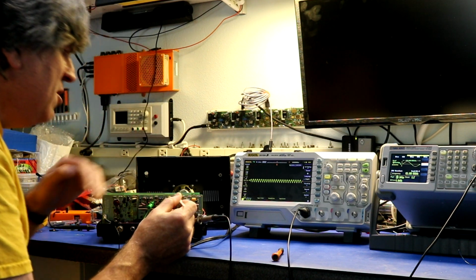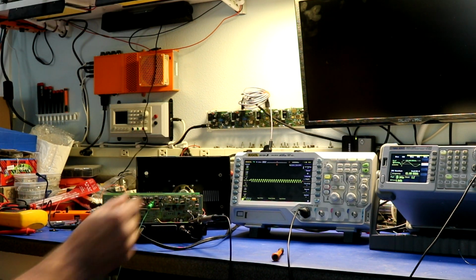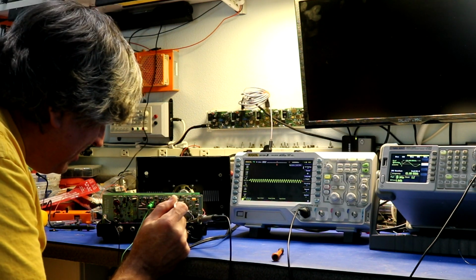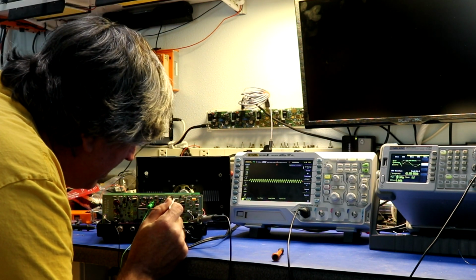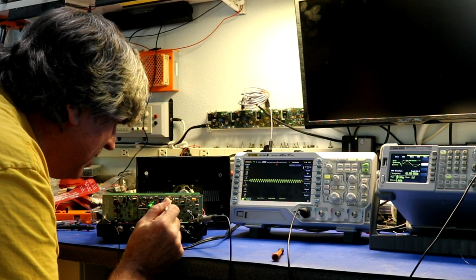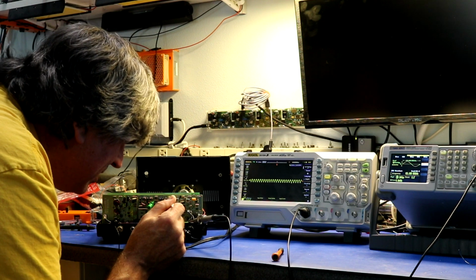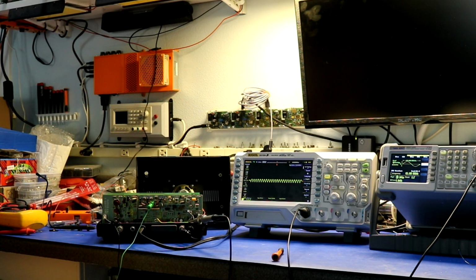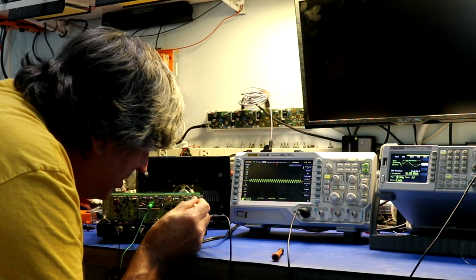Now this one here is actually all the way maxed out on its stop. And that suggests to me maybe there's a little bit of a problem, because you'd expect it to not be maxed out. Maybe some other component has gone out of spec on it, like the capacitor next to it, or there's a resistor here. A little bit troublesome that we can't peak that any better, but we went from detector toward mixer, and then we could go back and you could do it again.